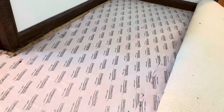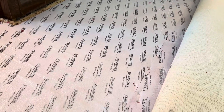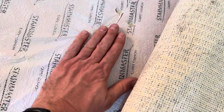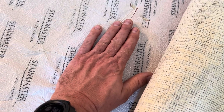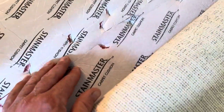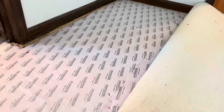So should you at some point decide to put carpet padding down, I recommend it — it's a great idea. Just make sure that the installer knows they're supposed to tape it. If you put a piece of tape across that that's also got a moisture barrier on it, it won't let water through. They'll tape it up here too. That's how this is supposed to be done instead of staples, so keep that in mind and y'all have a great weekend.